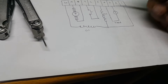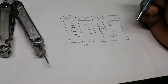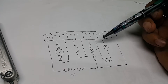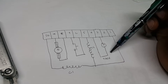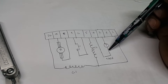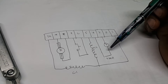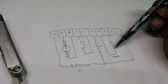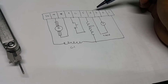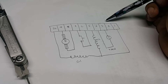This is coil number two. I forgot to explain in part one what the function of this component is — this is the tachometer. We are not going to test using this one because it is used by the washing machine board to determine the speed of the motor. It connects to terminal number three and terminal number four.